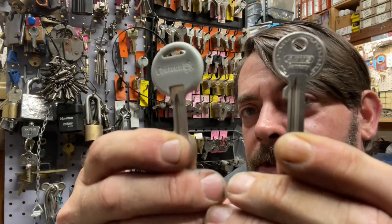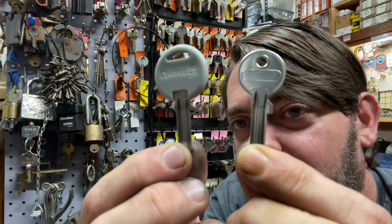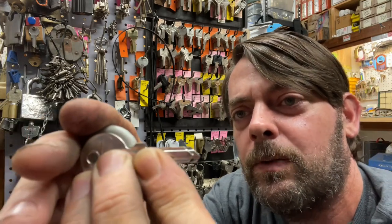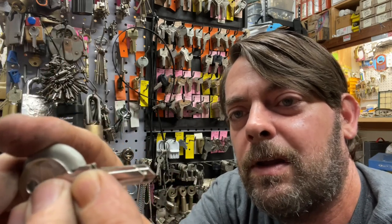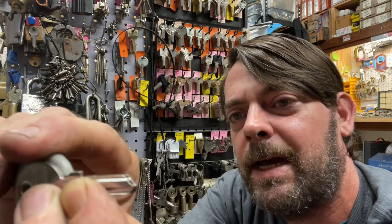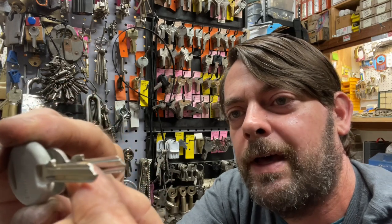we see it's the same blank. But it's not quite. Also, the Y52s or the Y whatevers, this particular one is actually longer. We can hold that up and see that the Chateau blank is a longer blank that is easily rectifiable by indexing it from the tip and just cutting that shoulder back. There's plenty of room to cut the shoulder back on that.